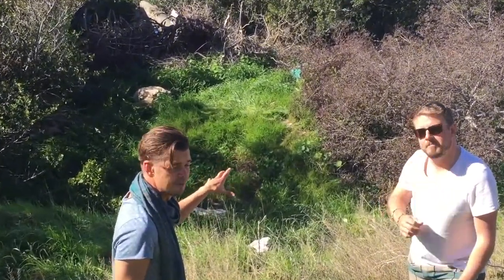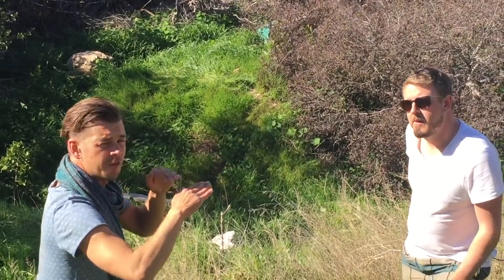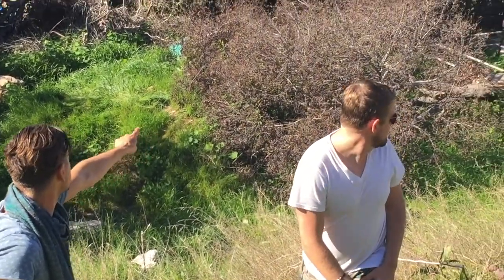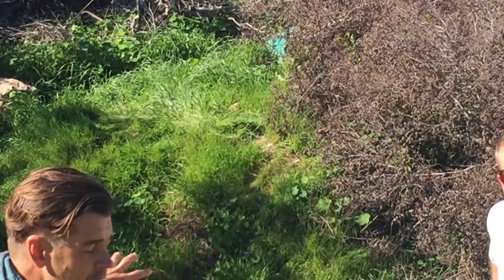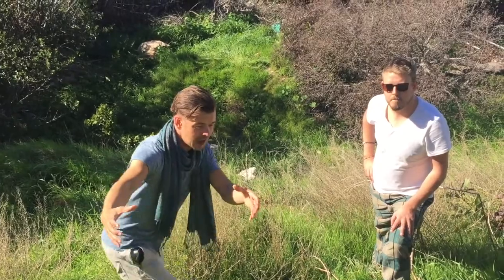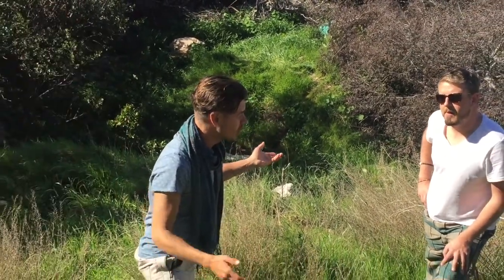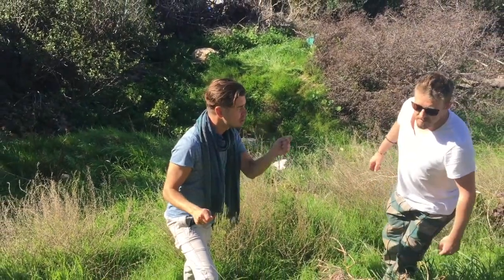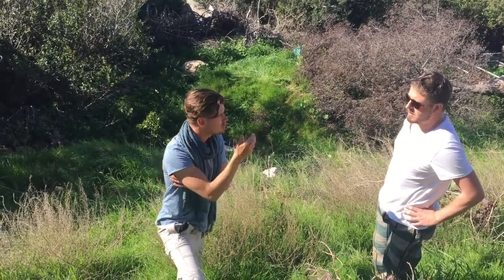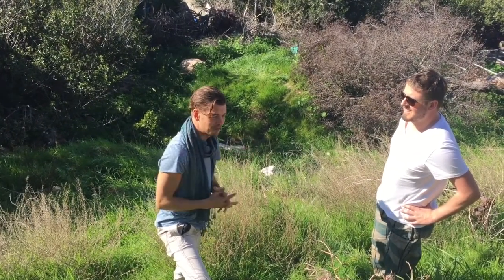We're planning to have a 25,000-liter water tank, and below Devon's house — where those rocks and trees are — we're suggesting a little bean-shaped wetland with a few temporary smaller wetlands going out to the servitude. That will treat all the greywater from the entire house and send that water back up here to irrigate the fruit trees and the rest of the garden, possibly via a header tank so toilets are flushed with treated greywater. The entire garden will be irrigated with drip irrigation under mulch — little pipes going to every fruit tree.